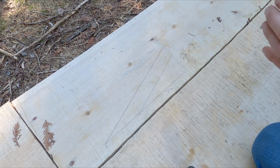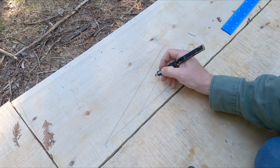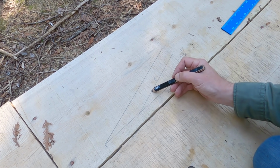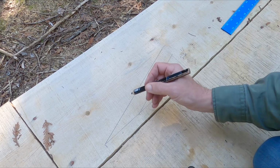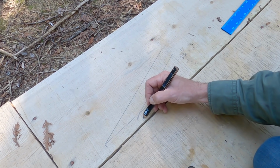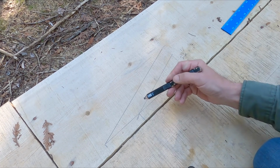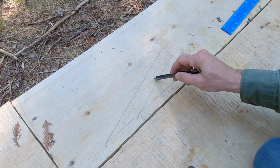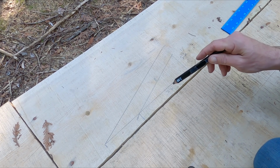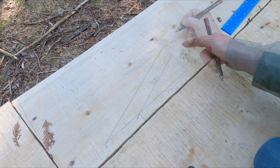This is 7.5 feet. And then the question is, how long do these boards need to be? 8 feet. So that actually works out really well. This board that I'll need to mill a bunch of, actually we'll probably have it hang over a foot here so that the snow and water will drip off there instead of running down the side. So that's a 9-foot log, which is perfect. That's easy to work with, easy to mill. Make them like 9.5 feet each log. Mill them up, then we get lumber for that.